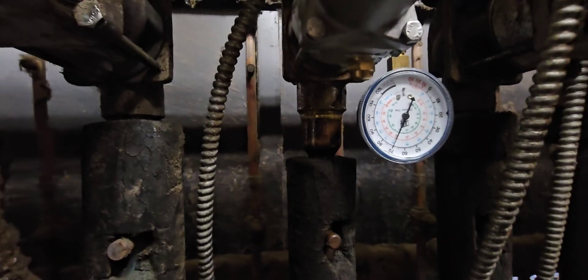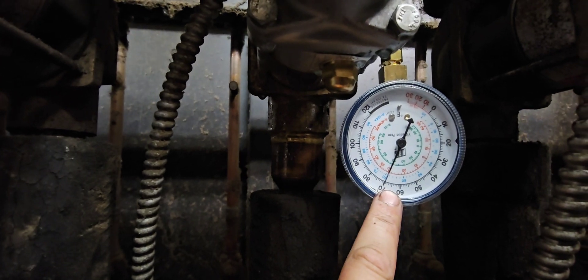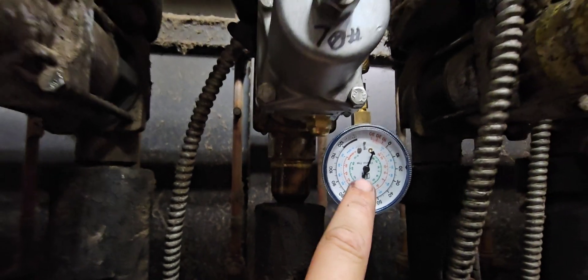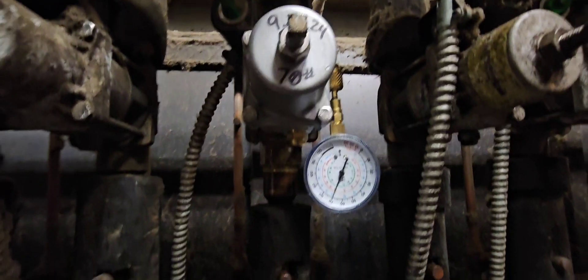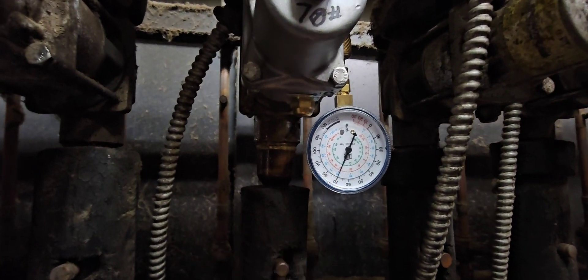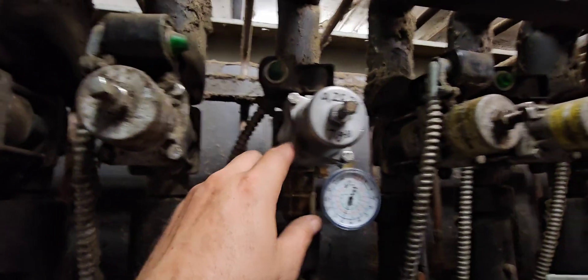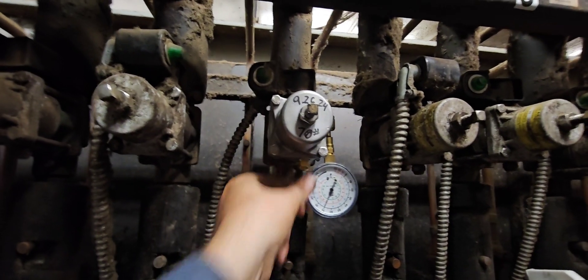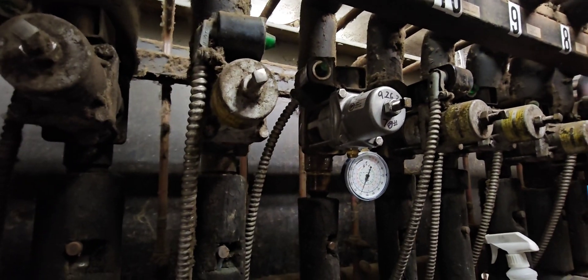This thing's been running for a bit. I decided to set it at 70 PSI — that's a 30-degree coil — as opposed to 72 PSI which is 32 degrees. The last thing we're going to do is put it in a defrost to make sure it holds in defrost, and then that's it for this one. As always, I appreciate the support — make sure you like, subscribe, and share. Thank you, later.